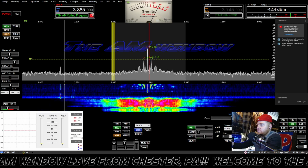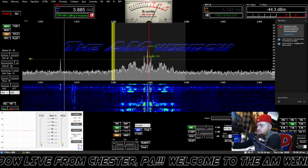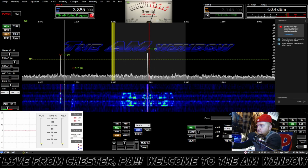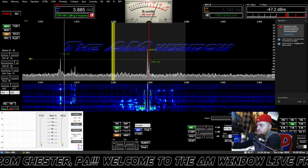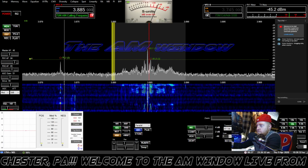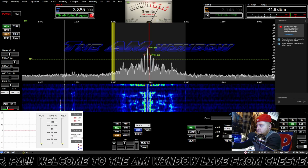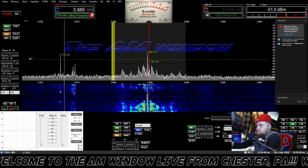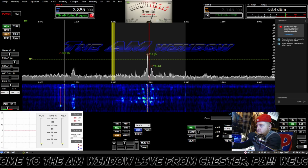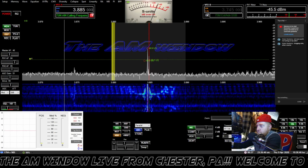Now I'm looking for a B&W 850 band switch. I put one in my 813 amp. I was going to build another amp, but then I got to get another plate transformer. This is only a half an amp, this plate transformer. I can go up to 5,000 volts with it. I got two oil-filled caps at 5 kV each. The full-wave bridge.